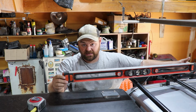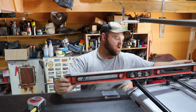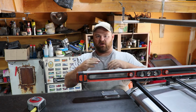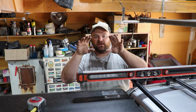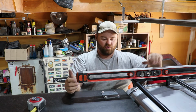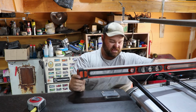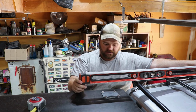because you actually get quite a bit of flex in your vehicle frame between the bed and the canopy. I've actually looked in the rearview mirror and watched as it does this. You'll see the bed actually going like this and stuff. So you need to actually give it some clearance, and boy, I might actually go higher than that.